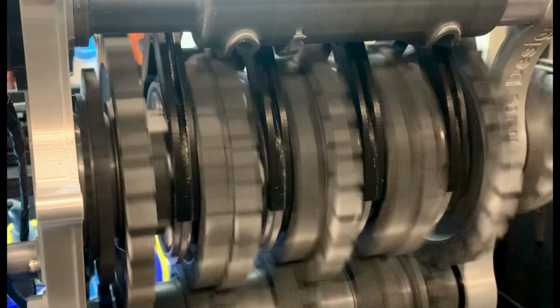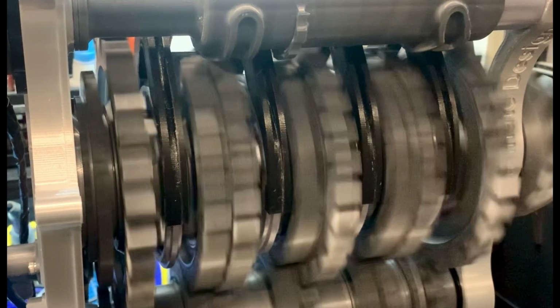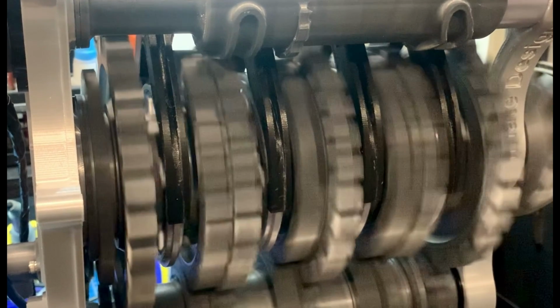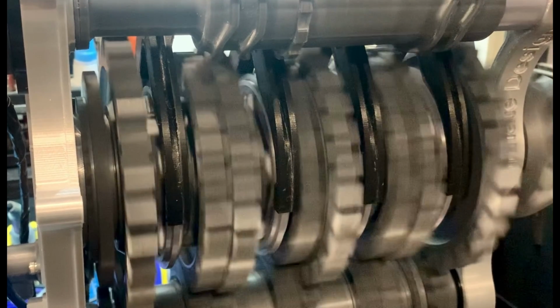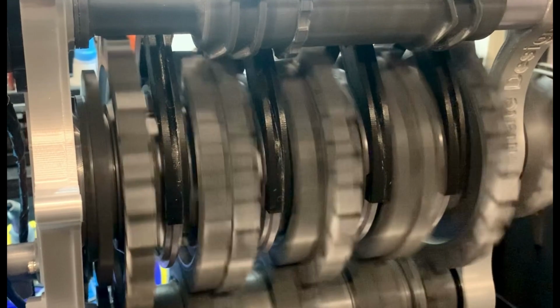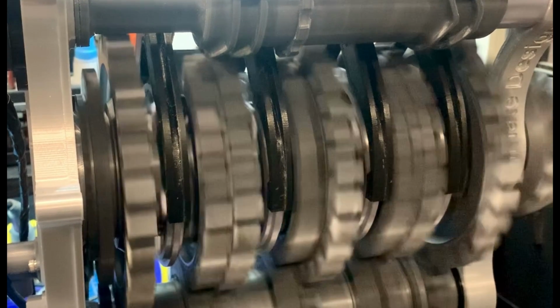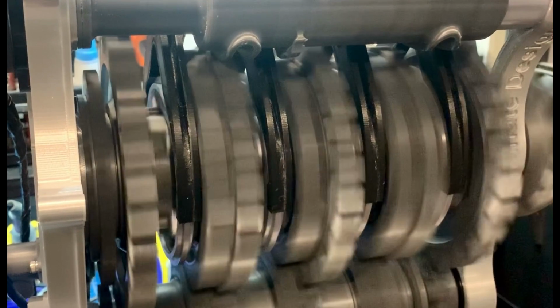If this gearbox was ultra precise and infinitely stiff, you might not need that torque cut, but I know the real F1 gearboxes and almost all real sequential gearboxes still do a torque cut very similar to this. And it actually, again, increased the reliability of the shifts dramatically, and it gives them a nice snapping, popping sound, almost like a real F1 gearbox has. If you've ever seen them come down pit lane, you just hear a nice pop as it's engaging each gear. So, that's really all I'm going to do for this version 1 of this gearbox.